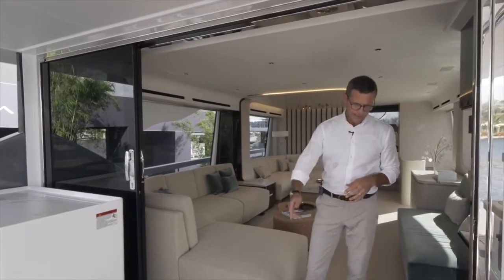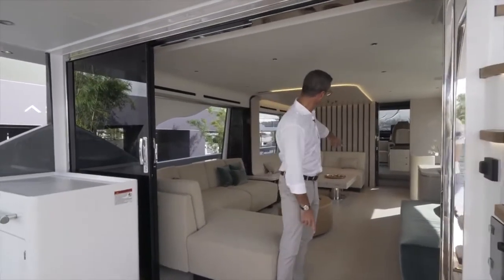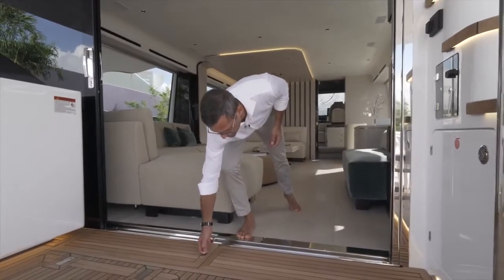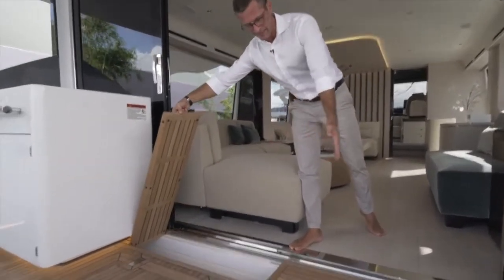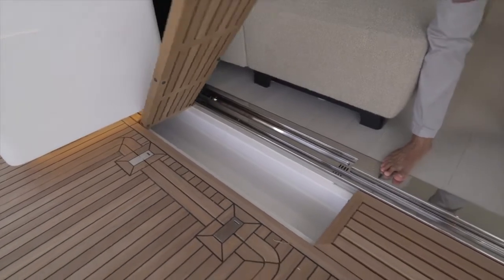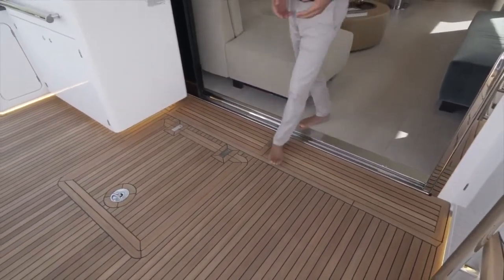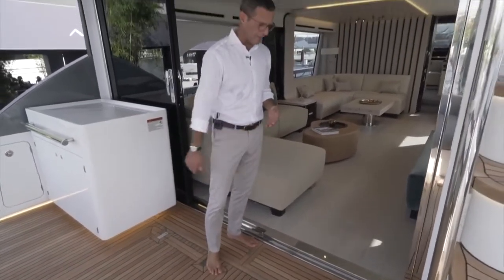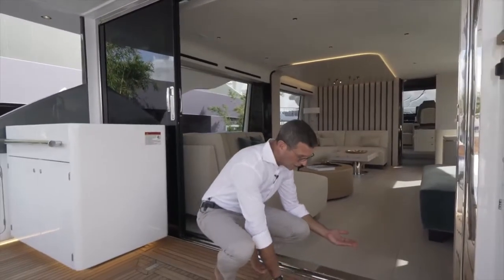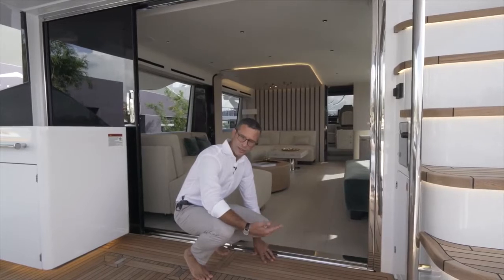It is because of safety. Now, going through here, I always like to say that from this step on the beach platform all the way up to the helm station and galley, you have no steps. We achieved that through this oversized drainage system, which, as you can see, is a massive drainage system that goes from side to side, beam to beam of the boat. So in order to have no step to the door, we needed to engineer this drainage system, and of course it's a no-brainer. Again, it's safety. Sometimes with bad weather you can have backflash of water coming into the cockpit, so to meet the construction standards you need to either have a step in order to block the flush of water, or an oversized drainage, which of course is a no-brainer.